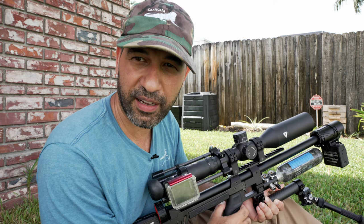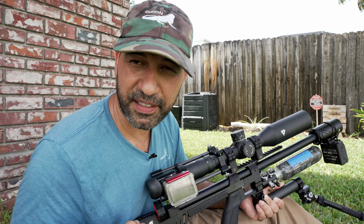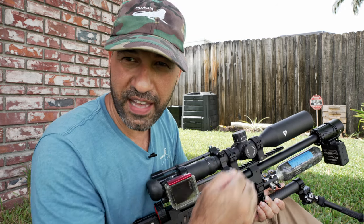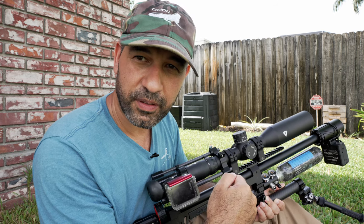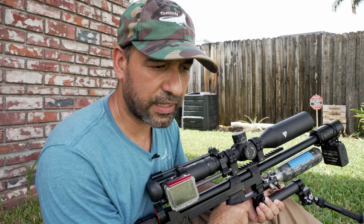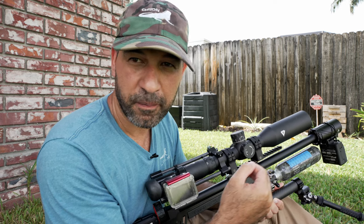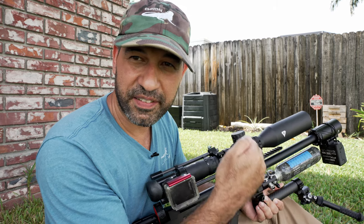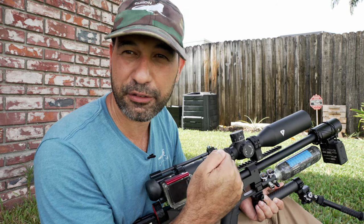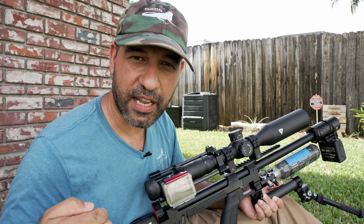So what I will do right now is reduce the regulator pressure and then repeat the procedure until I have it at around 888. And here is where I've been struggling, going down in speed. If you go up, the valve will behave better. I was told this valve is more efficient between 120 and 150. So if you keep the regulator pressure in that range, the valve will be way more efficient. I was pushing this to the extreme because my regulator is at around 85, where the pressure is low.